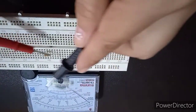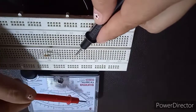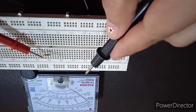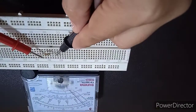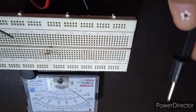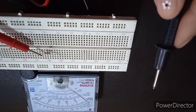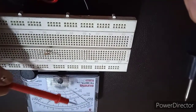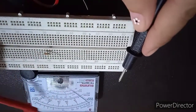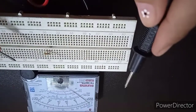If you try to measure the resistance value and the needle fluctuates to zero, your resistor is shorted. Again, if there is no deflection no matter how you change the test probes and no matter how you change the range limit, your resistor is open. On the other hand, if your needle deflects to zero when you test both terminals, your resistor is shorted. Those are the proper ways to check a good or defective resistor.